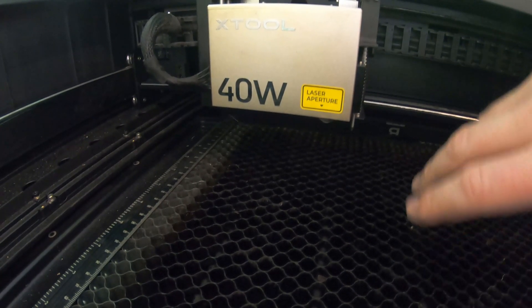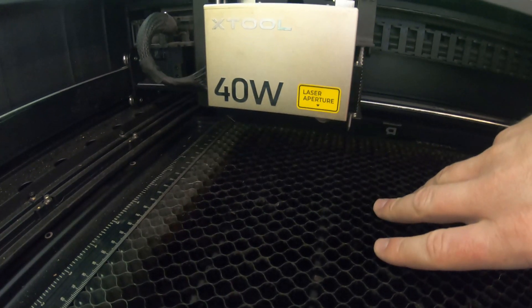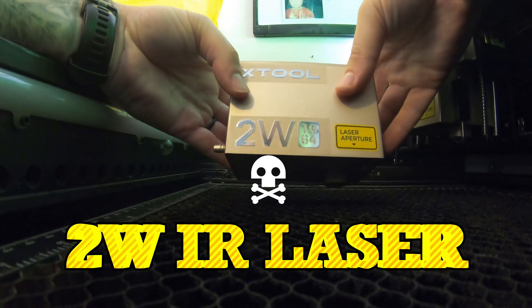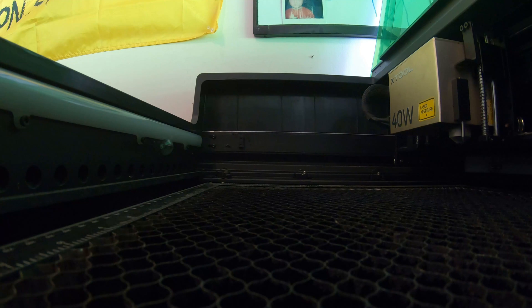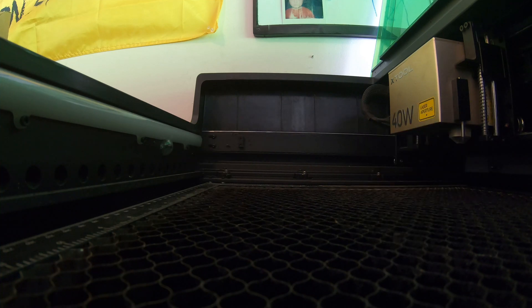It keeps those burn marks at a minimum. It also pushes debris out so that when it's lasering, the debris gets blown out and it can actually burn deeper — so you can get deeper cuts using the air assist. I highly recommend having it. It has been a world of difference. Also, having that airflow through there can help keep your laser clean. Now, things I recommend not to get: the 2 watt IR laser. I would not get this. It's still good, it's just not worth the money. If you're planning on doing a lot of metal engraving, you might as well get a fiber laser. This is just for base level stuff like bracelets or necklaces, and that hasn't been much of a seller from our experience.